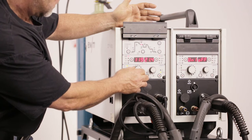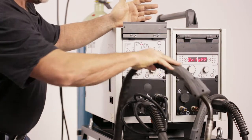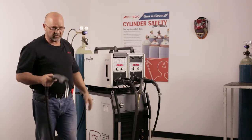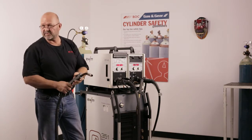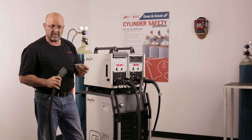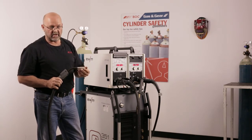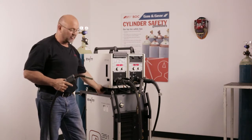I'm going to dial in roughly what I think will be okay. The unit is water-cooled. Should you want to be doing some pipe procedures on force arc, there is a program in here called force arc which could be running above 30 volts. Water-cooled guns are a must if you're running above 30 volts.